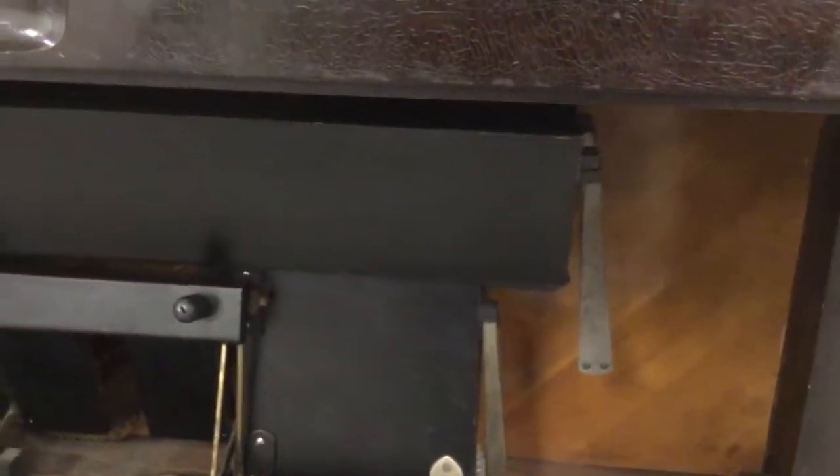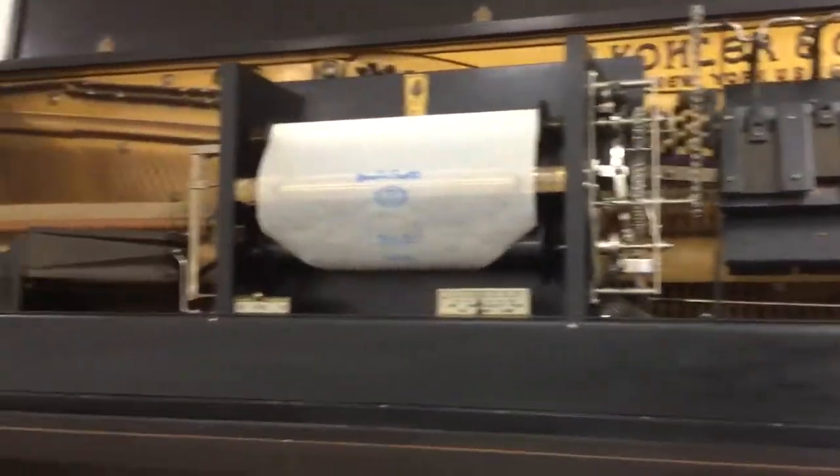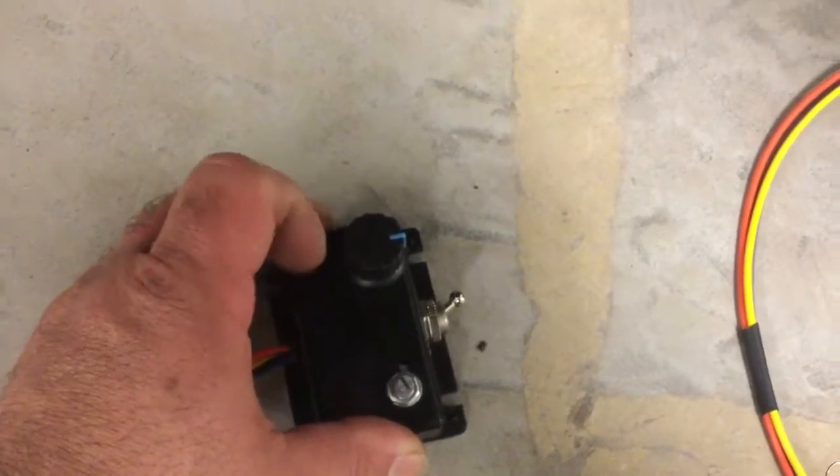The main reservoir bellow should just close — getting to the position where the spring is fully compressed, or maybe just a little before that point. That would be the maximum vacuum level available when foot pumping, and I don't think you should use the suction pump to overdrive the mechanism. What I've done is adjusted it so that when the speed control knob is pointing straight up — with the blue mark facing straight out — that is the normal playback position.